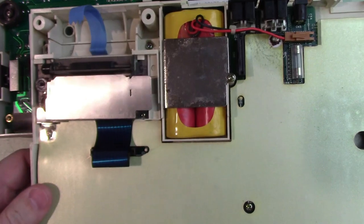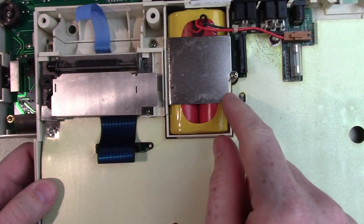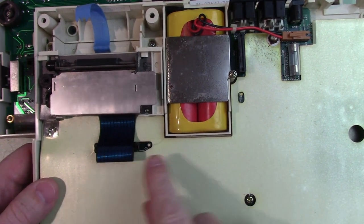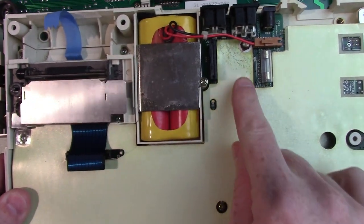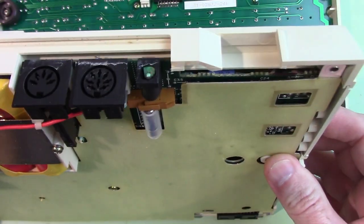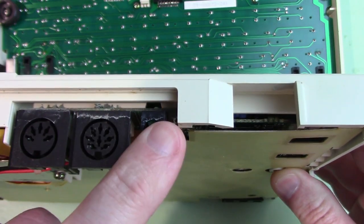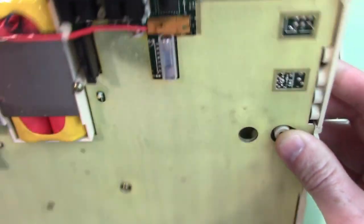Here's the bottom of it — there's the battery pack. I don't see any obvious liquid around it, but there's definitely some signs of corrosion and a little bit of rust. There's some kind of liquid residue there, and you can see that screw is rusted. If you look in the front, there's definitely some residue and the power port is very green, so I have to clean that out.